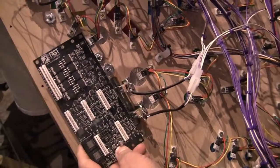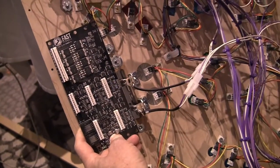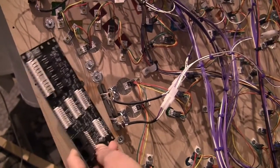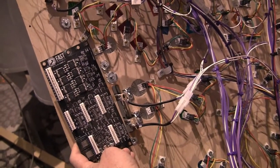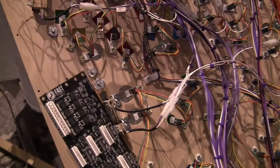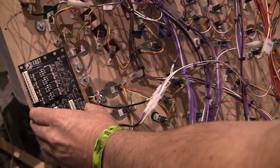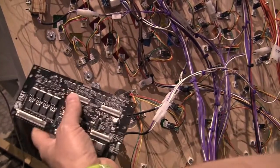It depends if you have enough room. It might be nice to have it flat if you have enough room to get to the connectors, but a lot of times real estate on the bottom of the machine is a little tight. From an electrical standpoint, it doesn't make a difference. In this case, I would probably mount this one up because we do have side rails for when the machine is being serviced. Even though we have considerable space on the side to put it flat, if we set it on a counter or get near those rails, it's going to interfere.